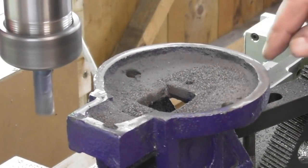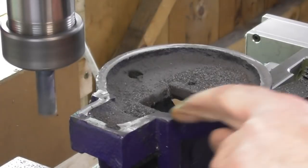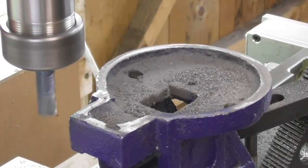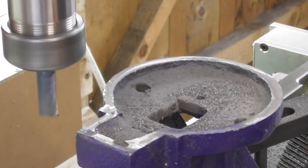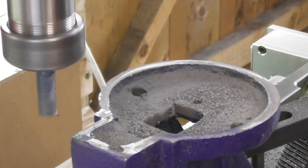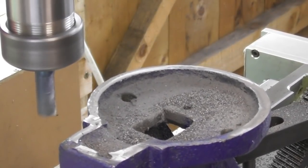Okay, so I've been around this and I've taken 30 thou off it now. There's a little area there and a little area here. I reckon another 5 thou and we'll just clean it up just as well while I'm here. So yeah, there's another 6 thou there. Okay, so I think I'm going to save my hands. I've been winding my hand back and forth. I think I'll do it in a series of left and right passes now.